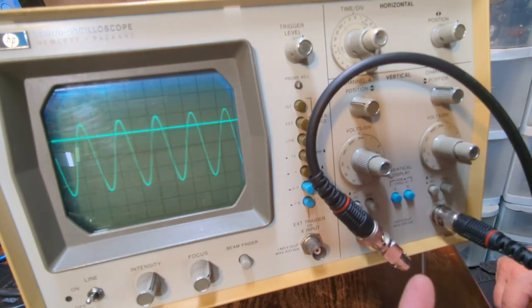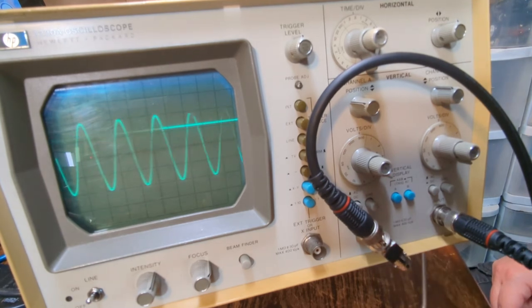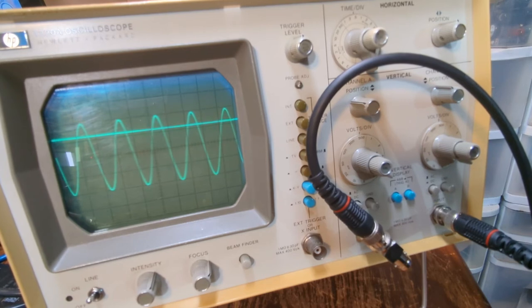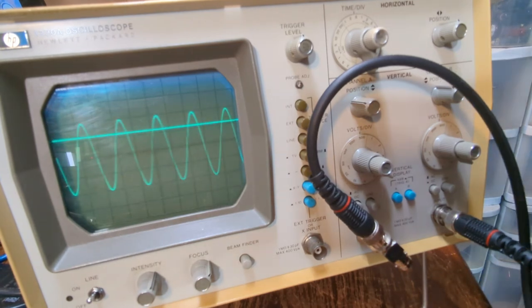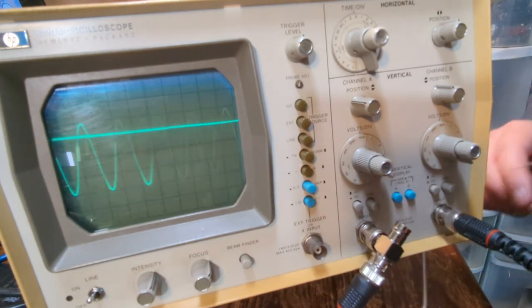But anyway, you can actually take and put a resistor up in that center conductor and then solder the other side of the resistor onto the... As a matter of fact, I'm going to demonstrate that right now to you. I'll get a 50 ohm resistor. And really, it doesn't have to be a 50 ohm resistor. It can be a 47 ohm resistor. So this resistor reads 48.9. If I turn this around here like this and just stick one end of this in here,